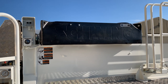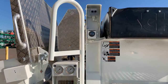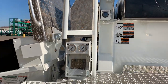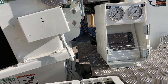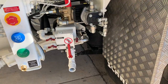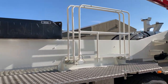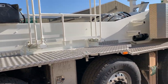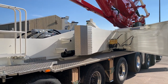Here we have our 160-gallon plastic water tank — you can add a tank heater to that, but this truck is going to Texas so it does not have that. We also have a water tank level gauge and ramp change station. Optional on this machine is the high-pressure washer; that wand is located right at the back of your hopper. Another option this customer chose is our fall protection system — railings affixed to the rear fender to provide protection when you're up on the deck, and we also mount some railings up front.